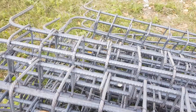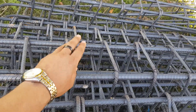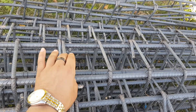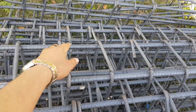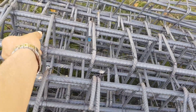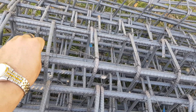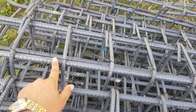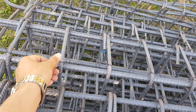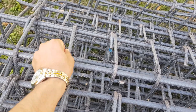If you look at this, you can see here — this is what we call the binding wire. The binding wire has been fixed and is basically used to fix these rings with this column. Now, what is the mistake that has been made? The steel fixer has just fixed it and left it as it is.